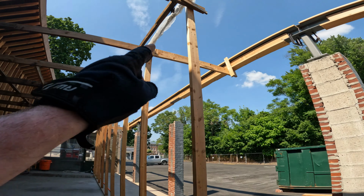Now, as we put the rafter up, we're also gonna add the rafter tie on the bottom, which is our 2x10s. They sent us 28 footers because they didn't have 24 footers. But I told them 26 footers. Based on the plan, it was gonna be about 25 feet or so. And that's this here. This is a rafter tie.